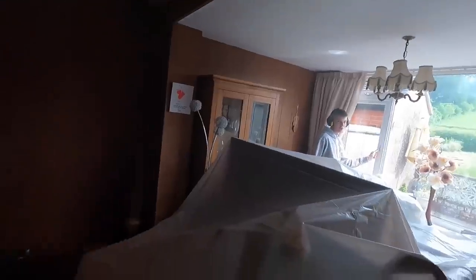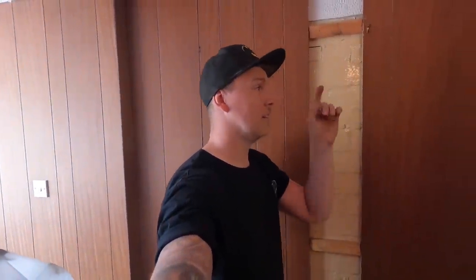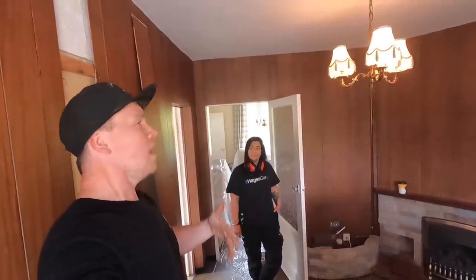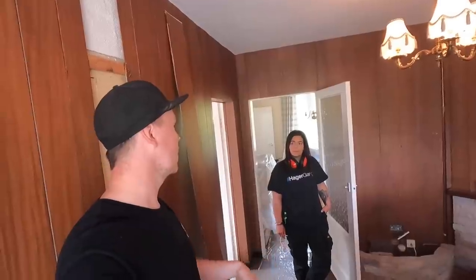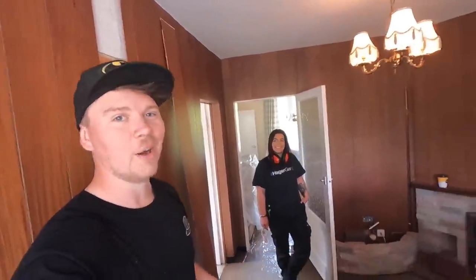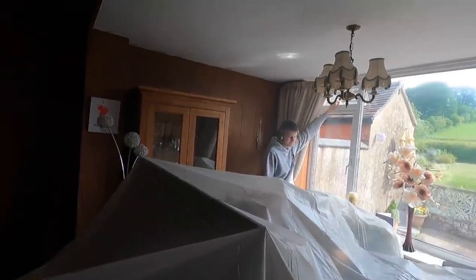Because we're using 35mm pattresses, we'll just sink them in a bit. The last job I got elastic for in Telford - I put them all in the ladies nail room, screwed them flat, and everyone was like 'oh you can't screw 35mm pattresses back.' But the builder told us it was all getting boarded out, as in furred out and then boarding on top. I wasn't very clear on that in the video.